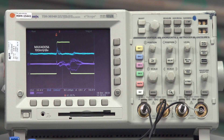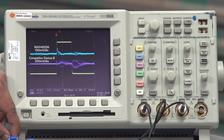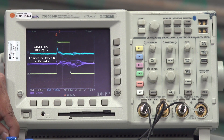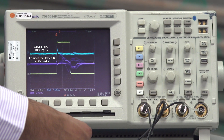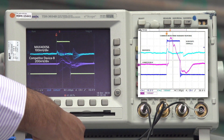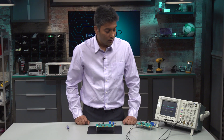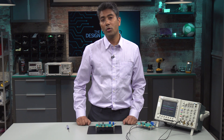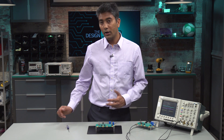And it does take longer to settle. Moving to competitor B, you can see the outputs are unsettled yet. And in this case, if I change my pulse width to minimum, which is two microseconds, you basically are seeing that the outputs of the competing device have not settled yet. But MAX456 has settled long before. And changing the slew rate of the device to about 1 kilovolt per microsecond, you see the performances are aggravated at the output. But you still see MAX456 error is still negligible. Now that we looked at the PWM common mode rejection performance, let us actually look at MAX456 being put in a real application.